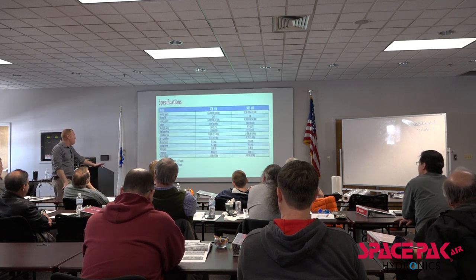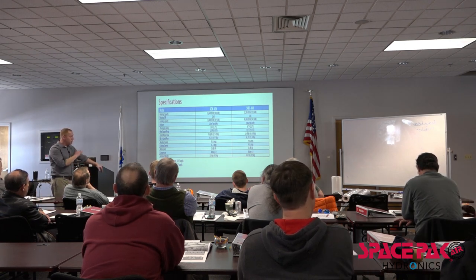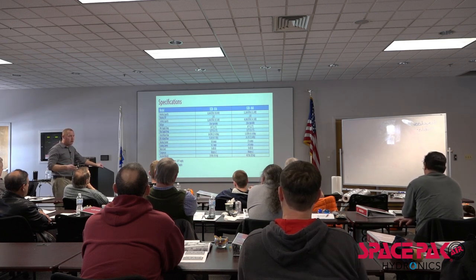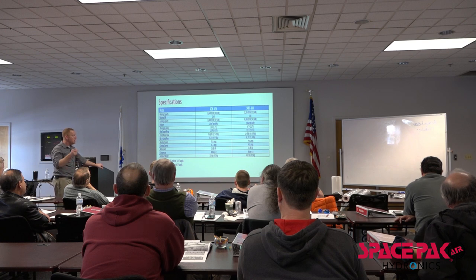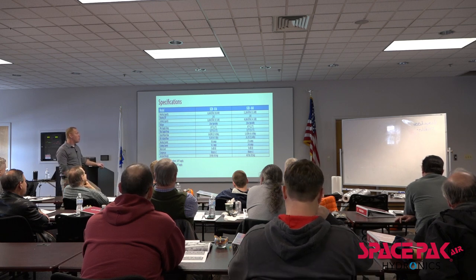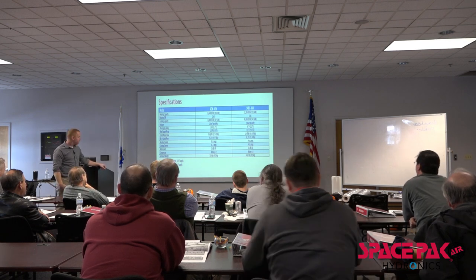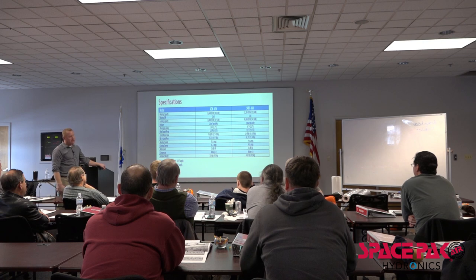So what's our output, right? What can we do? Our heating capacity, on this chart particularly, is at 47 degrees outside ambient. When I said these are more designed for the cooling application, they still do heat because they're heat pumps. They're reverse cycle chillers, reverse cycle heat pumps, but they're not designed for low temperature heating outside, okay? In a heating capacity at 47 degrees, that unit will provide 52,000 BTUs of 120 degree water temperature. Our cooling capacity, it'll deliver 48,000 BTUs of cooling.